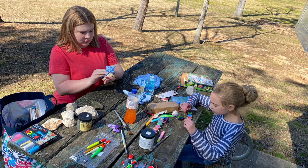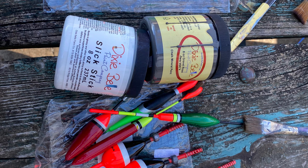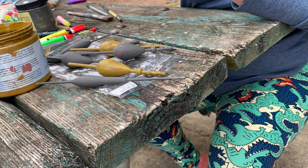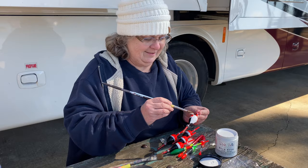I used Slick Stick on them from Dixie Belle because they were very slick from the previous painting on them. Then I put a coat of Gravel Road to have a deeper color underneath it, and then I put a coat of the Mojave over it because I thought I would sand down and distress a little bit. It ended up that I just used some brown wax over that, and we sanded the back edge flat so that it would be able to adhere to the dresser with a little bit of wood glue,